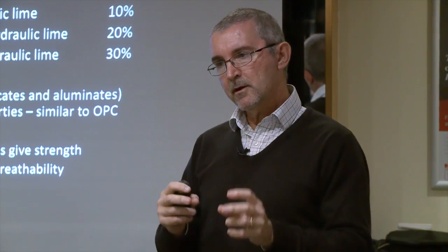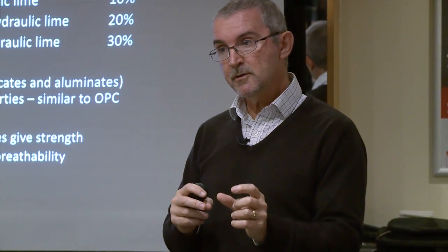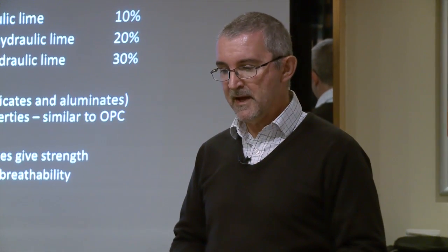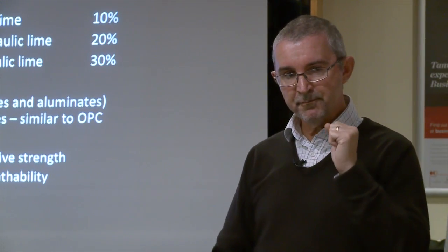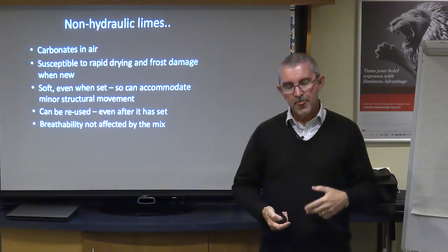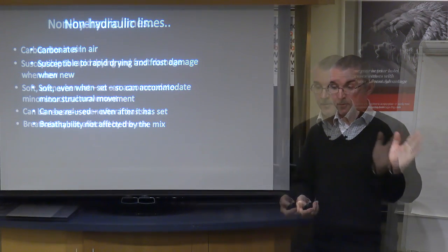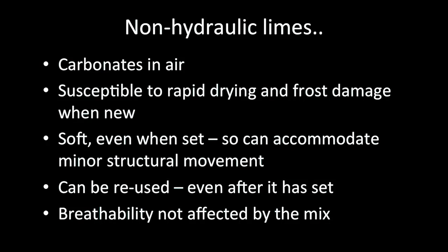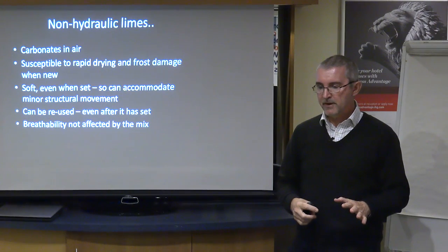So it's really clear that the decision to use an NHL mortar has to be thought about for what the consequences of that are going to be. So there's a direct trade-off between strength and breathability. The difference between that and a non-hydraulic lime is that there is no trade-off. Non-hydraulic limes are completely breathable. So it can get saturated, you can chuck a bucket of water at it, it can get wet, and then it will dry again. The water will be able to escape and it will release itself through natural evaporation.